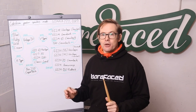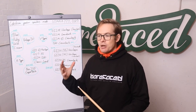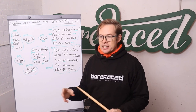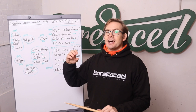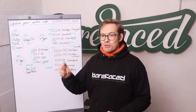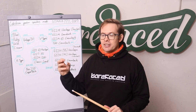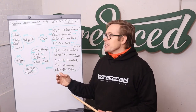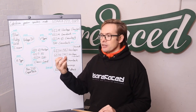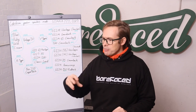Alnico is not a very stiff magnetic material. Some permanent magnets create a very rigid magnetic field, and some create a much softer one. Alnico creates quite a soft magnetic field, so when a voice coil has current running through it and creates its own electromagnet, that electromagnet pushes back against the Alnico magnet, which actually weakens. This produces a subtle compression effect which rounds off and smooths the edges.